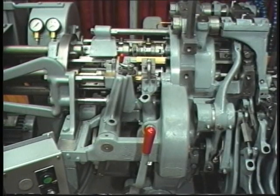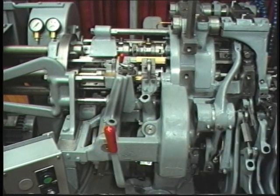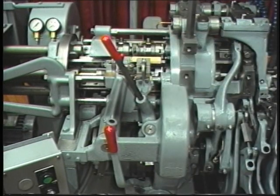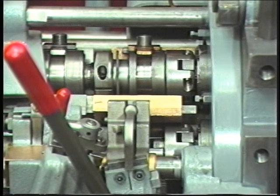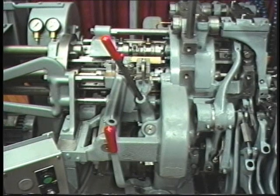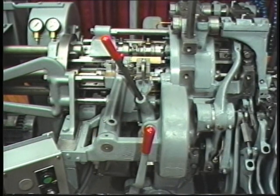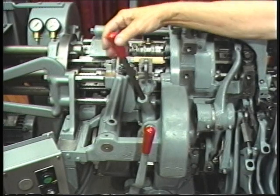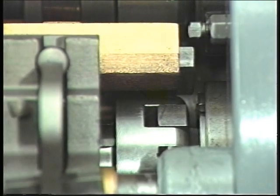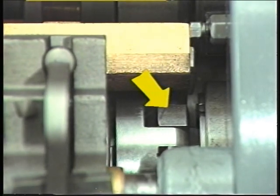Broken chuck levers. While stocking, check for broken chuck levers on each spindle as follows. Engage the starting clutch. Open the chuck. Manually turn the hand wheel so that the chuck lever is in sight. Disengage the starting clutch. With the cam lever handle, manually close the chuck. If the chuck lever is broken, the piece closest to the revolving head will not move when pressure from the cam lever handle is exerted to close the chuck.